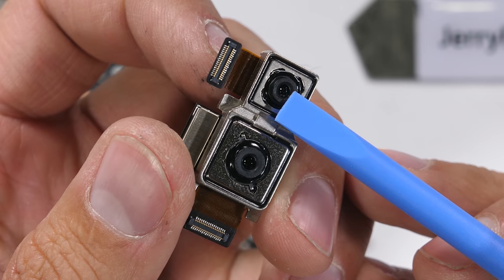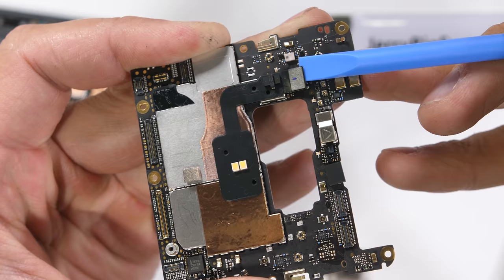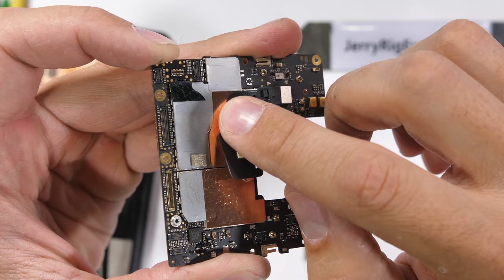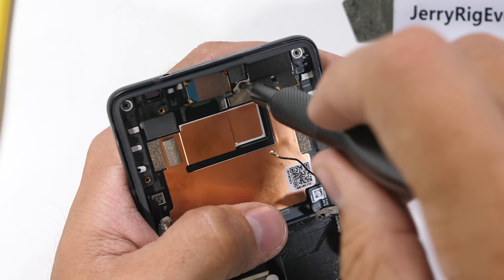The motherboard has dual rear cameras plugged into the back, each with their own Lego-style connector. The normal 12 megapixel camera comes with OIS, but the 2x zoom lens does not have any hardware stabilization — electronic maybe, but nothing visible from the outside. HTC does always have to stick some weird stuff in their design, like this dual LED flash on its own removable ribbon cable. It's probably built this way so that it would line up dead center on the back panel between the camera lenses, but it still feels like HTC forgot about it and had to add it back in last minute.